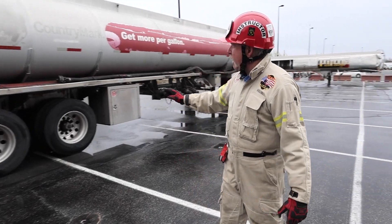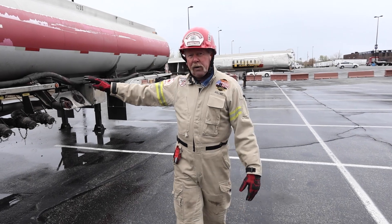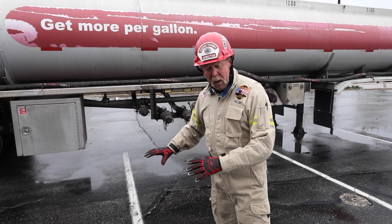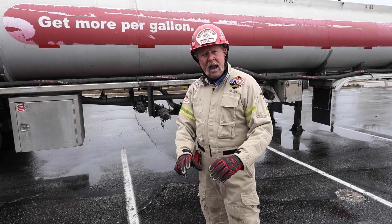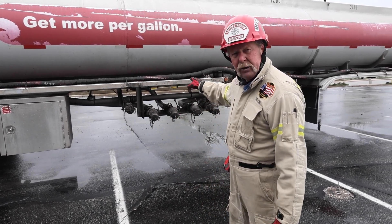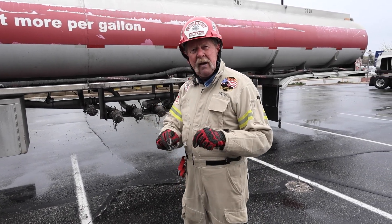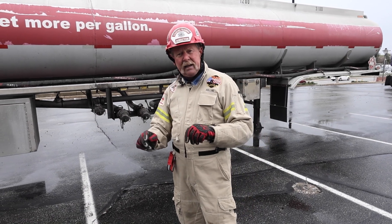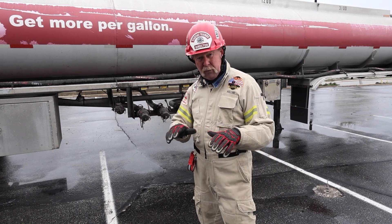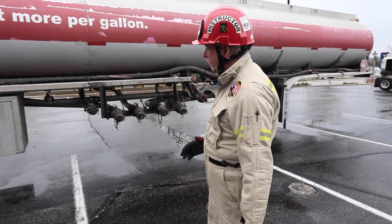As we come down the side of the tanker, you can see the various hoses carried up top along the side. As a general rule, the larger hose is for liquid when delivering product, and the smaller hose is for vapor. The black hose is a high-pressure hose used when the operator has to pump gasoline from this tanker to an above-ground tank — that's a rated pressure line. So there are three types of lines: a liquid line, a vapor line, and a pressure line. That's typical for one of these gasoline tankers.